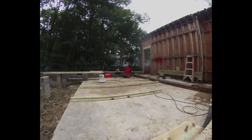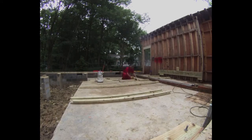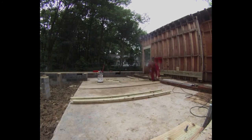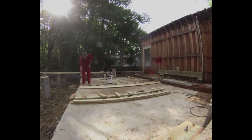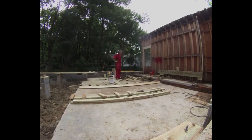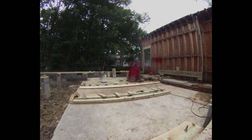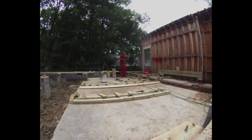I thought I would try to tackle this crawl space. I actually did all the block work myself for this addition, and wouldn't you know it — as soon as I started digging, we hit bad dirt. I think the bottom of the footings are at about seven feet, and I think we poured two truckloads of concrete on this job to build it up, and I still had about a five-foot wall of block to build all the way around.